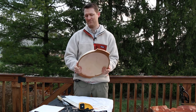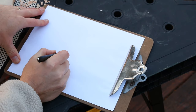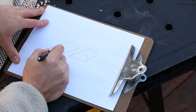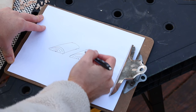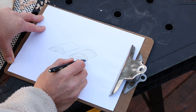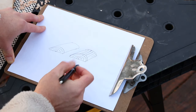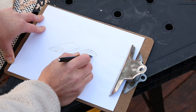In order to do that effectively I'm going to draw some diagrams. So let's say we have a log that we've split — two halves with the pith here and radial growth rings. The wood is composed of fibers that run lengthwise, and when the log is cut it cuts through those fibers. We generally call the area where the fibers are cut the end grain, and the areas where it's just the side of the grain, the side grain. The end grain, where it's exposed and cut, is going to dry much faster than the side grain.